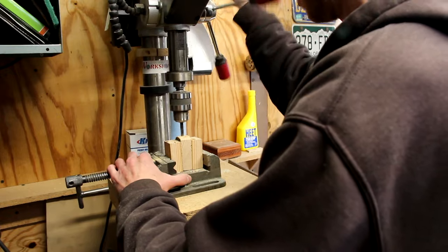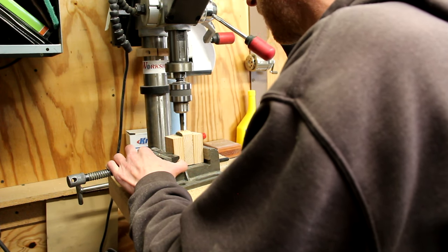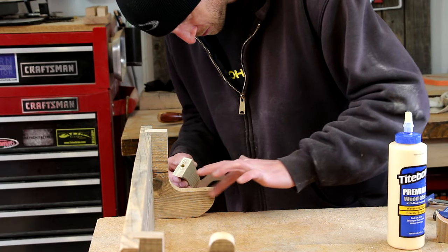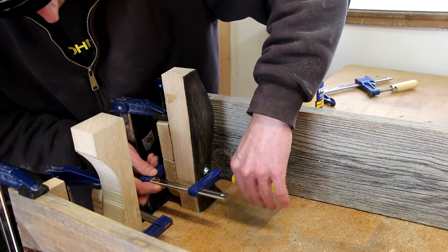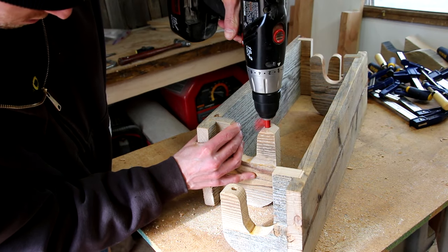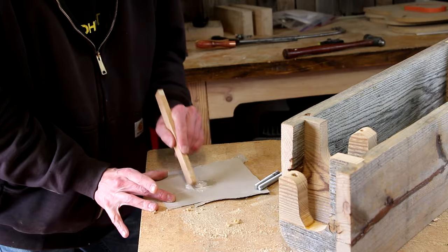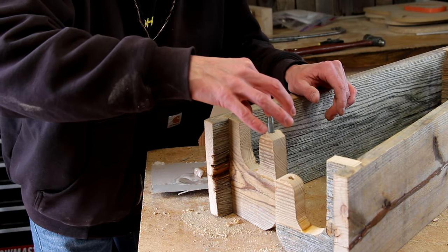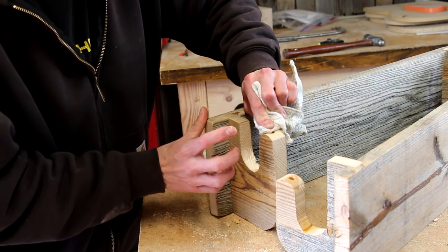Even after breaking both those pieces, I'm still going to use that steel rod idea. But this time I'm going to drill it out on the drill press. It looks kind of crazy, but I think it'll work. Now using the hole that I've already drilled as a drill guide, I'll go ahead and drill the hole a little bit deeper so I can put the threaded rod down in there. I'll just cut the threaded rod down to size with a reciprocating saw. Now I'm just mixing up some epoxy, and I'll shove that threaded rod down in the hole, wipe off what I can, and let that dry.